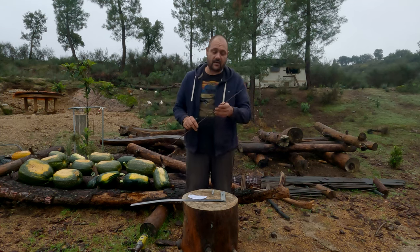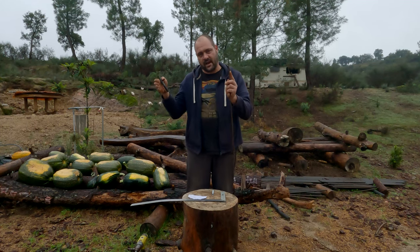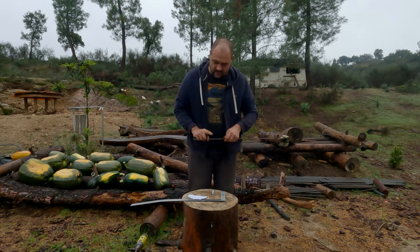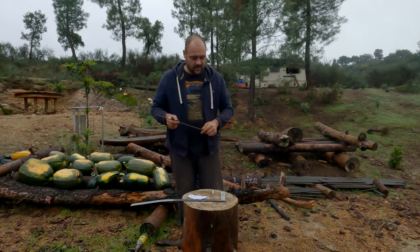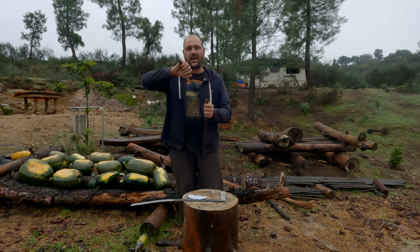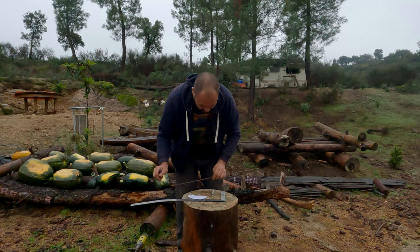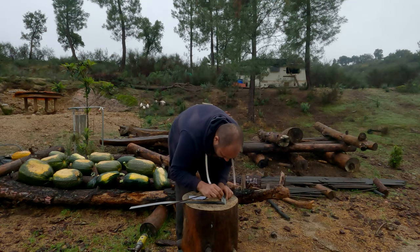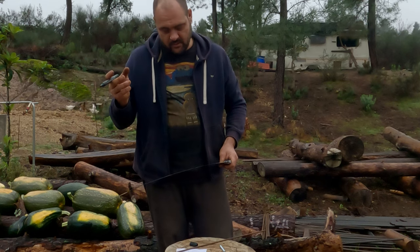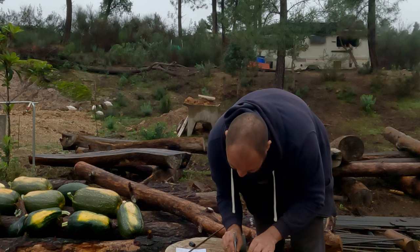I need 20 by 13, so I subtract the rebar thickness — my measurements are from the outside of the rebar to the outside of the rebar, so make sure you know what you actually need. That's 20 minus 0.6 on one side, minus 0.6 on the other, giving 18.8. I recommend taking off about a millimeter or a millimeter and a half for the bend, so that'll be 18.6. For the other side: 13 minus 1.4 gives 11.6. Also be careful — my screw is going here so I have to take that into account.